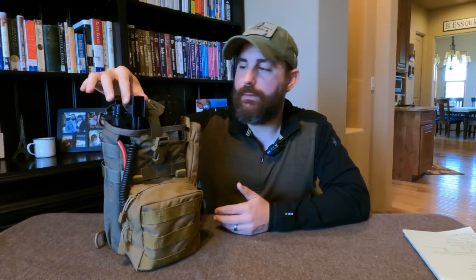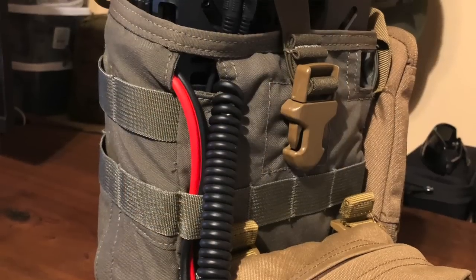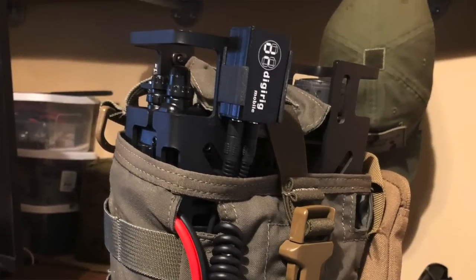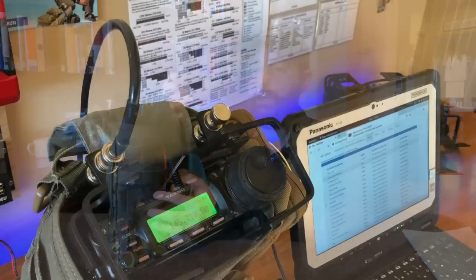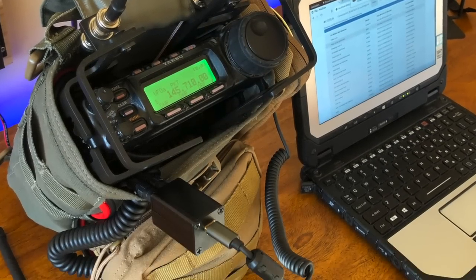It's all-band all-mode just like the 818, so we can do UHF, VHF, and HF — a very capable rig. It's what we call a shack in the box; basically like having multiple radios in one. It also has a data port and CAT control so I can make it operate on digital data modes. I'm using the Digirig Mobile, which has been my standard throughout this entire ManPak series. One issue I'm seeing is that when the Digirig is this close to the frame, there are interference problems — the solution is to let it sit off by a couple of inches.